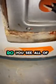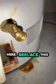Here's the flammable vapor sensor. Usually that goes off if there's any type of flammable material around — paint, household cleaner, anything like that — and it'll shut off the water heater. But upon further inspection, do you see all that rust and water residue? Another technician came here and replaced this, which is the actual relief valve.